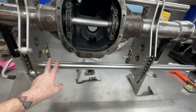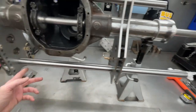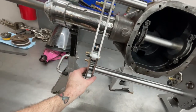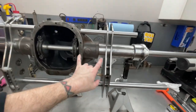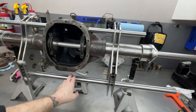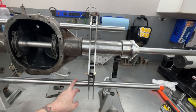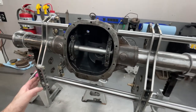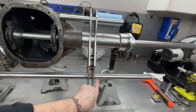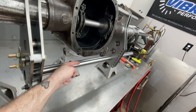There may be some spots I can't reach on the top and bottom, but that'll be plenty of structure — especially with this chromoly inch-and-a-half bar. These are long, so they'll get cut to 21 and a quarter inches, which is the outside-to-outside dimension. These are 20 inches center-on-center. The width overall is inch-and-a-quarter, so you add 20 inches plus one-and-a-quarter and that gives you your total length.